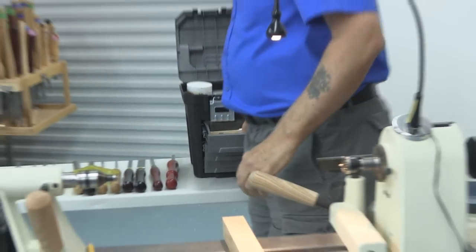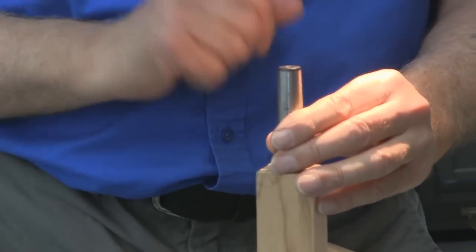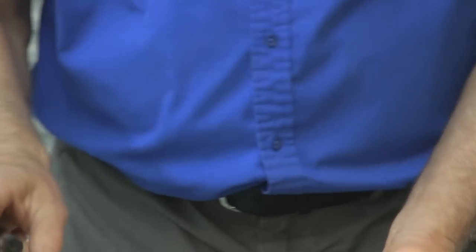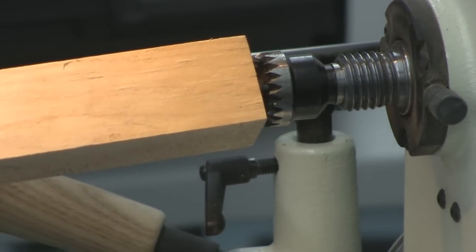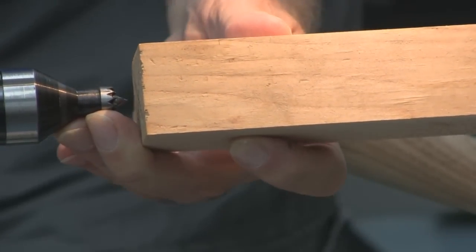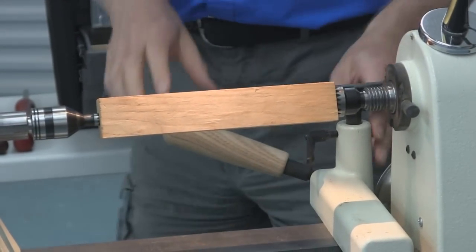on the lathe. Okay, now again, if you're using this four prong type spur, it's not going to seat in there just from pressure. You'll need to take a dead blow hammer and pound it in to seat it good in the wood. But with the stub centers that I'm using, you don't need to do that. The teeth are sharp and they'll bed themselves without having to drive it in. And that's mounting the wood in there.